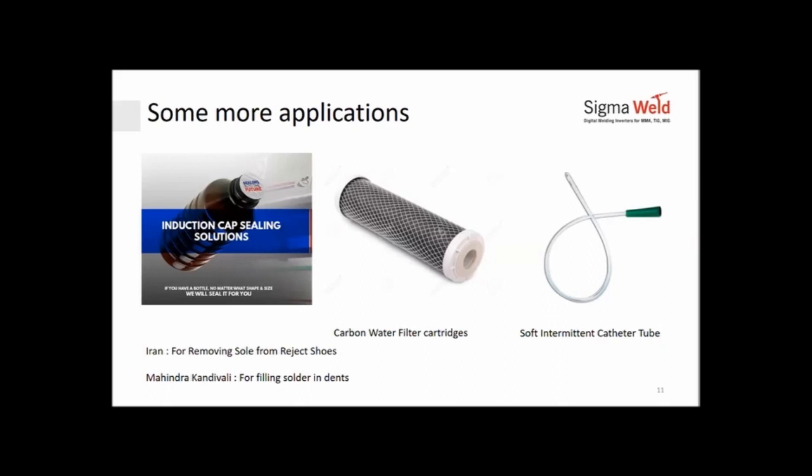Is there any way of heating non-magnetic material using induction heating? Tamirji, yes, you can, as long as it's a conductive material. It has to be electrically conductive. Frequency and power will do the rest. During case hardening, if you wanted to measure the temperature, sir, you'll have to use optical pyrometers and things like that to give you your actual reading.